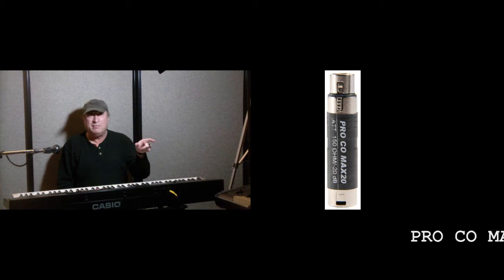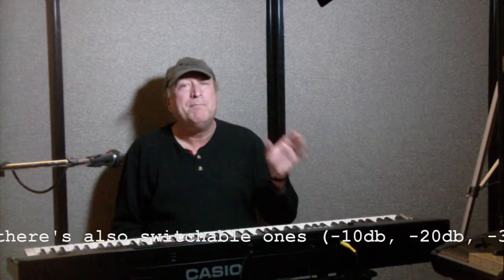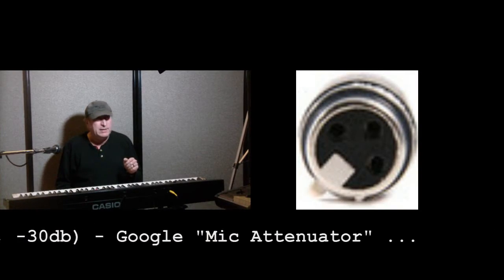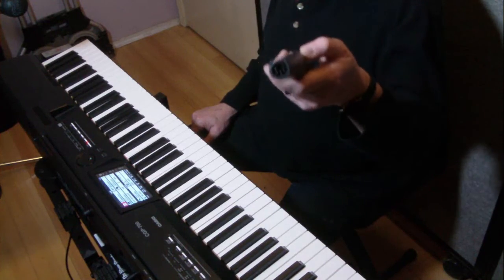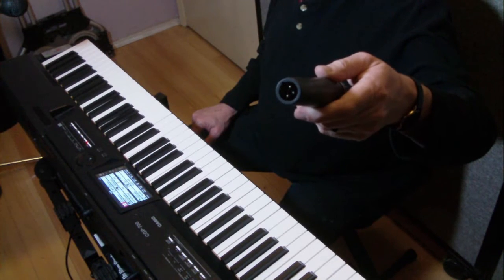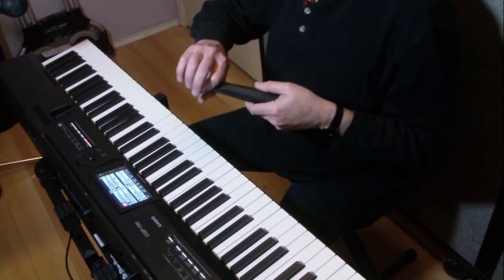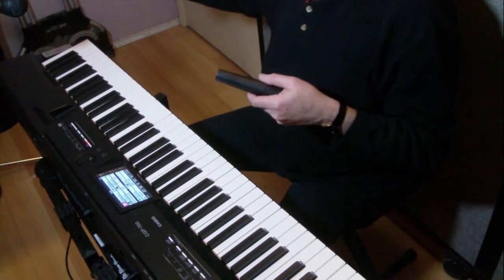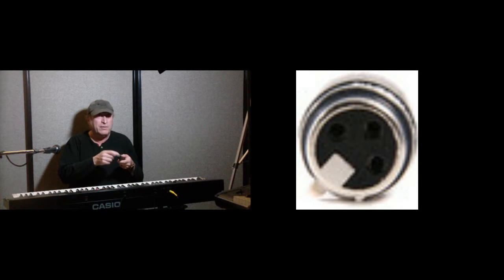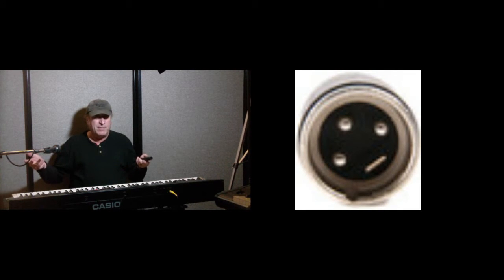The mic attenuator is this little thing you can see in the next frame. Mic inputs use XLR cable — if you take something like a Shure SM57, you can see the kind of connectors it uses: XLR, basically three pins. When you hook this up to a mic attenuator, the XLR female connects to the mic and the XLR male hooks up to the mic attenuator — it's a perfect match.